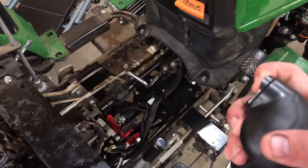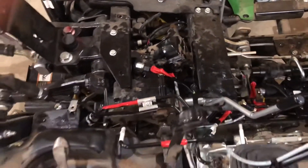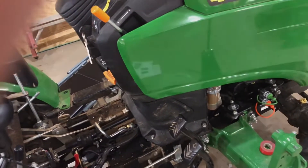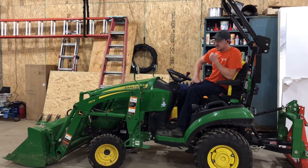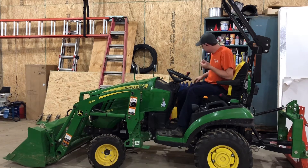Got no connections right now, so when I hit the SCV we're going to release. Now that I've got the tractor put back together, I'm going to go ahead and test it out. I've got the dump and curl of the bucket actually plugged into my mid SCV, so I'm going to hit the gray buttons here to move that.